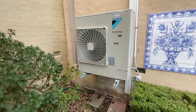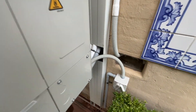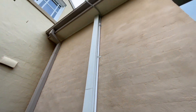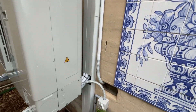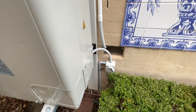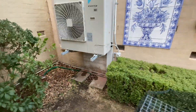That's it, it's done basically. Power comes out, up in rigid conduit into here — this is all sealed. That goes straight up into the back. That's the interconnect, that's power, all sealed at the back. That aerial cable is nothing to do with me. The aircon just comes straight down the eave and this trunking goes straight into the back, straight up. Got an isolator now. Because of this obstacle I just went coro into that instead of going over it. It's on galvanized brackets with galvanized fixings.